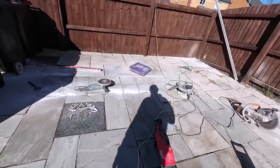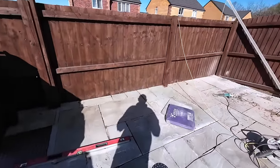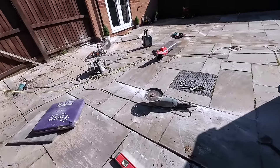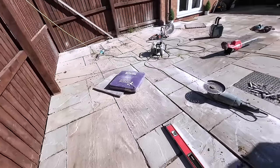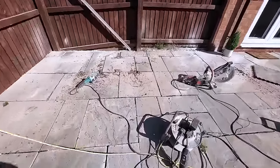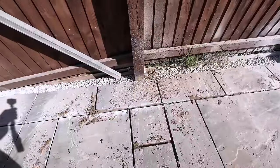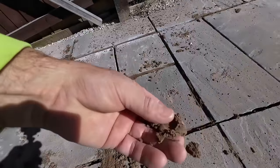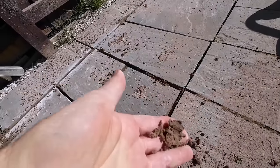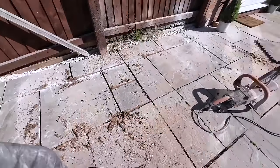It's not fun. It's got a big dip in it as well — the whole thing, the flags don't line up, which is made worse by no mortar being in the joints. You can see that one there — once we've jointed it though it's going to be a bit better. It's hard taking just a few mil off the flags — we've got a couple of marks on the flags, but it's still going to be better than it was. I've got the grinding plate, just taking the joints out as deep as I can. See how it's drying out nice and quick — look how wet that is. That was the mortar between the flags. I don't think there's even any cement in that. Don't even need the grinder to get it out — absolute disgrace. No wonder there's moss growing in it.